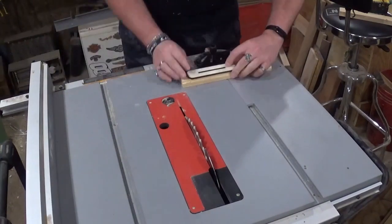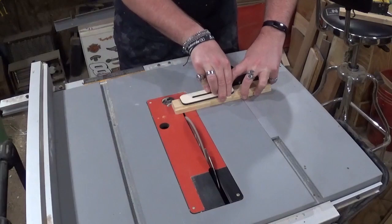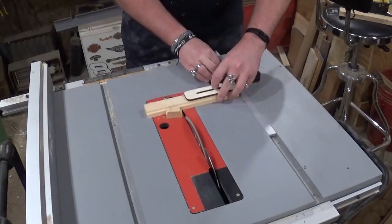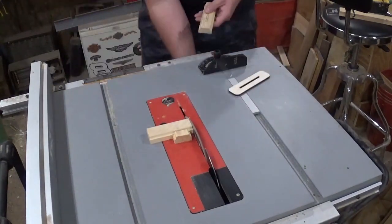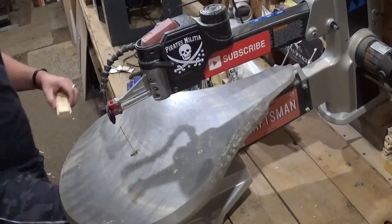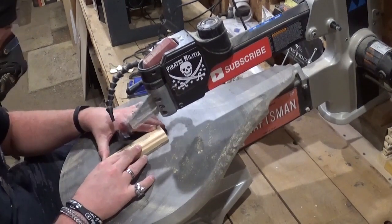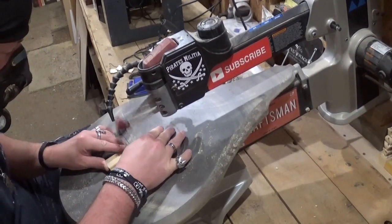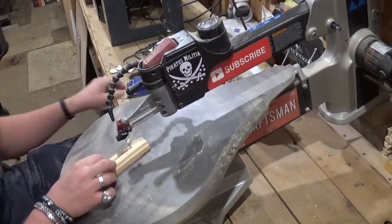And these are just basic crosscuts, and we will do those here. And once this is done, we can do a little bit of scroll saw work by cutting out where the tab will go. So that was what the pilot hole was for, and I'm now cutting out that piece here, being as loyal as I can to the cut line.